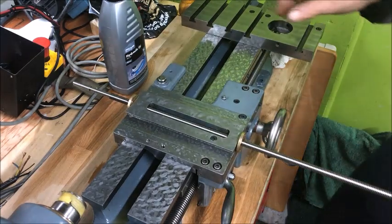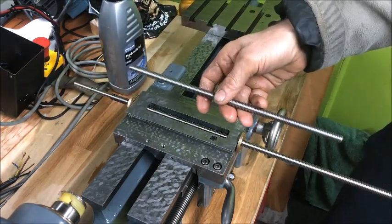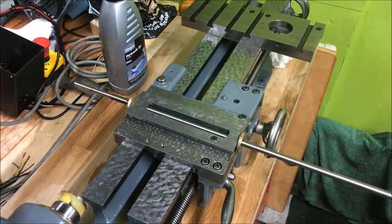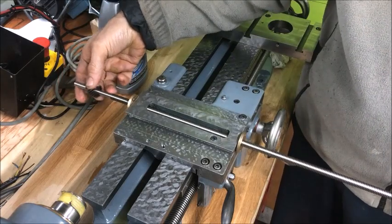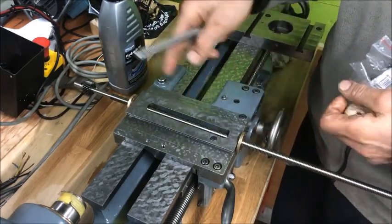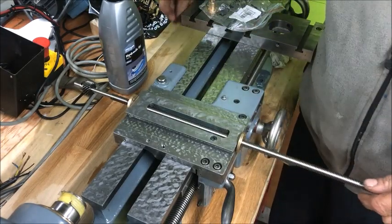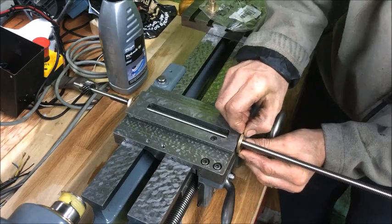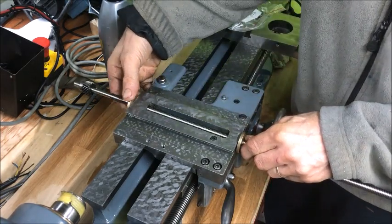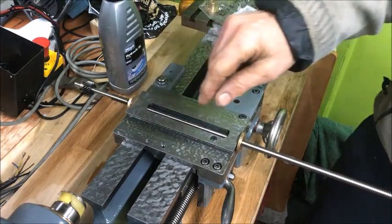This is all fairly obvious but I'll explain anyway. When I start this modification I take a piece of screw and turn it down to fit this type of gear. Then I turn down the nuts to fit here — half an inch and 12mm respectively — cut them to length, insert everything, and then either use the existing holes or line up a hole pattern I'm happy with. Then I snug it up until there's no play and scribe a line to cut.